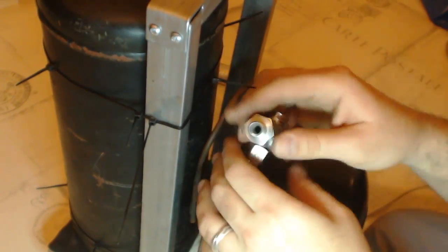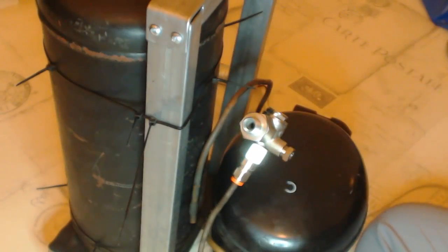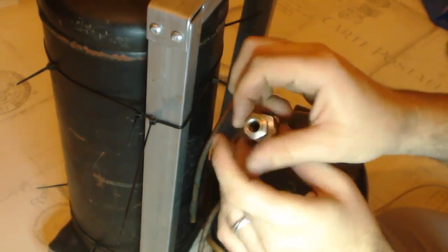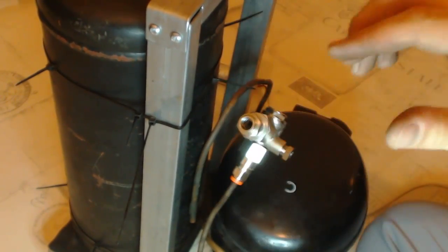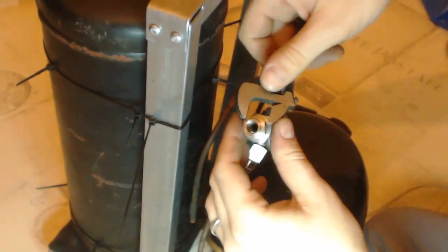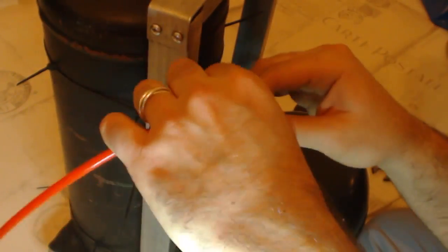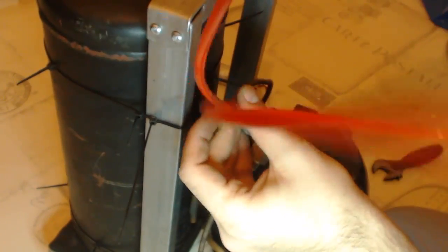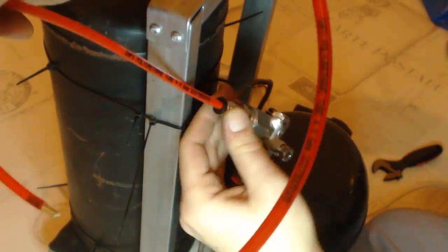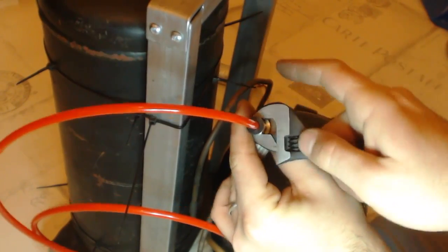All the parts are connected together with Teflon tape to prevent air leaks. Keep in mind that we use Teflon tape that is intended only for air tools and not for plumbing. This is because Teflon for plumbing cannot hold much pressure or tightening. We put together one more fitting to the tube. This is a high pressure plastic tube and can hold at least 10 bars pressure. With this one we will connect the one-way valve to the air tank.